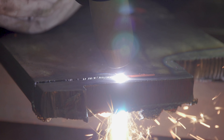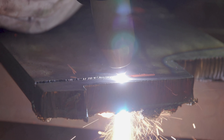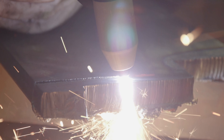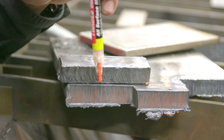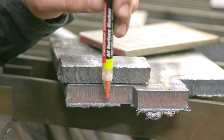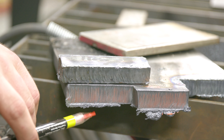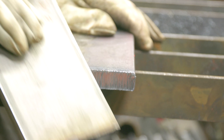I'm running at the high end of the max capacity of this Thermocut 40 amp machine. We're doing three-quarter inch with 40 amps — just think about that. If the cut came out good, I can move a little slower. We're looking for these right curves right here — that's really good. No melt edge on the top, and on the bottom it tells you to move slower or your machine doesn't have enough amps to push through.